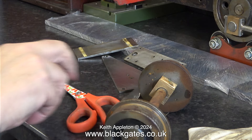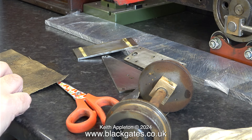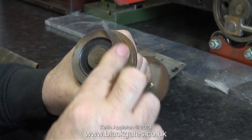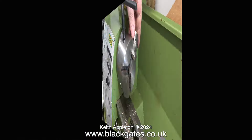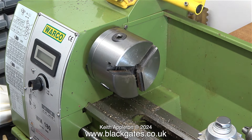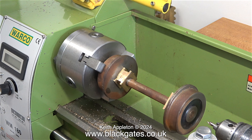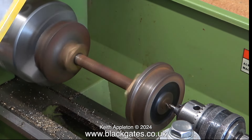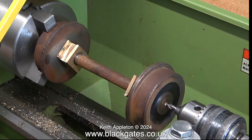Here I'm cutting a raggy edge off a piece of 400-grit wet-to-dry sandpaper, which I'm folding over for cleaning the wheels once I mount them in the lathe. I do need to mount them in the lathe for a couple of reasons — doing it by hand will take forever. Over now to the small Myford lathe in the smaller of my two workshops, and I'm changing the chuck jaws for outside jaws so I can hold one of the wheels in the chuck. Here you see the arrangement, and this holds the wheel very securely. The first thing I need to do is to drill a centre hole in the end of the axle.